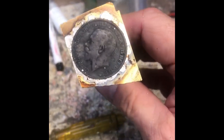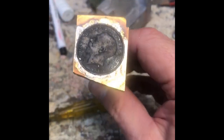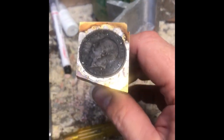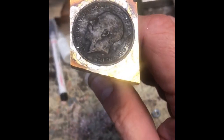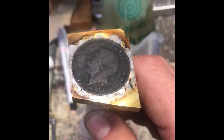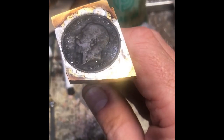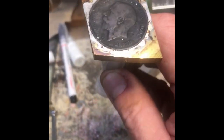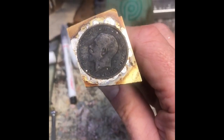This is the coin soldered in. I was able to put it under water and pump air into the back of it, and no air came out from around the perimeter — so I think it's airtight. The problem is that there's a lot of solder now to be cleaned up without damaging the penny. On the final job I will be able to solder one of the pennies from inside, so that would only need one side to be cleaned up. But now I need to work out how to clean it up without damaging the penny.